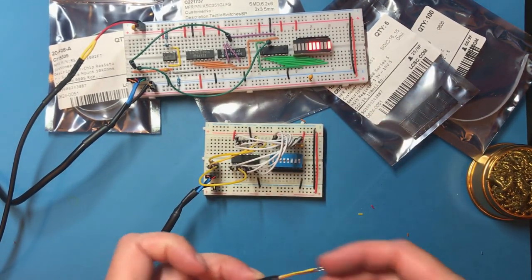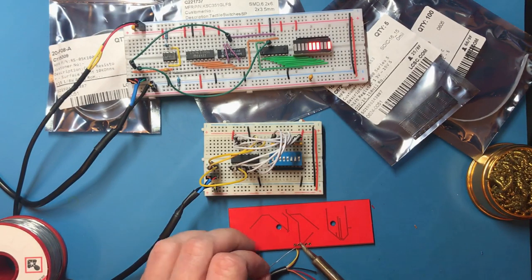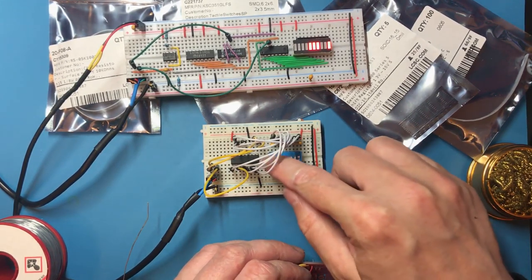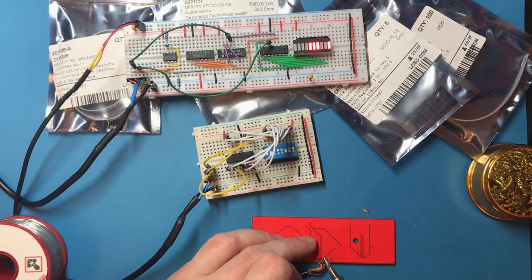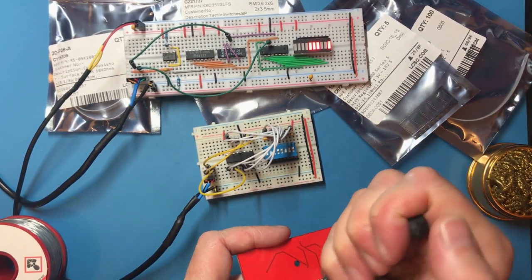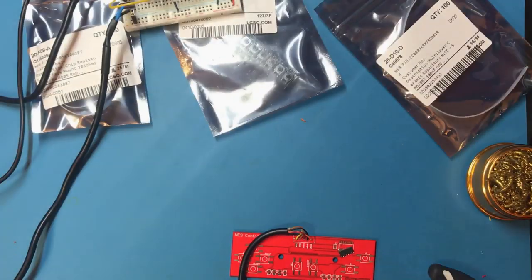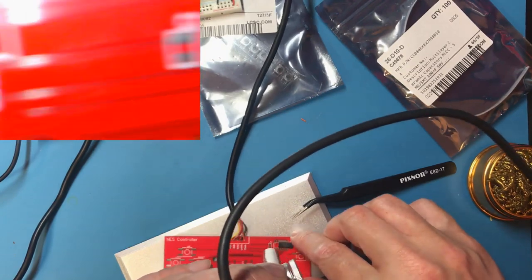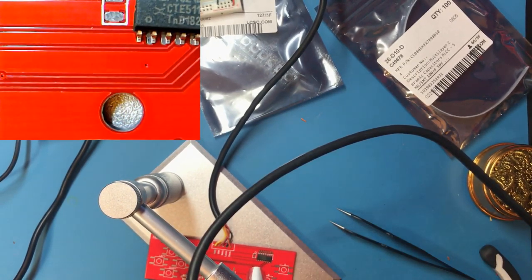So yellow is definitely VCC. Brown is ground. Our data comes in over here, so that's the red line. And latch is the top right. Black, orange must be clock. This is where I could definitely do with some side cutters. Let's get the chip in first. Immediately thinking I made a mistake by soldering those wires on because the board doesn't sit flat anymore.